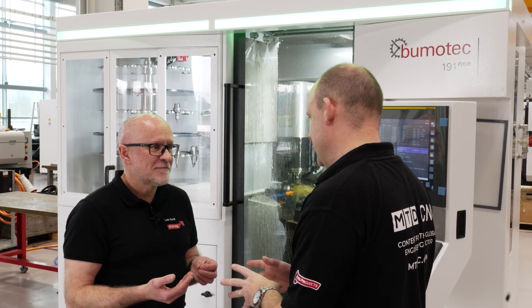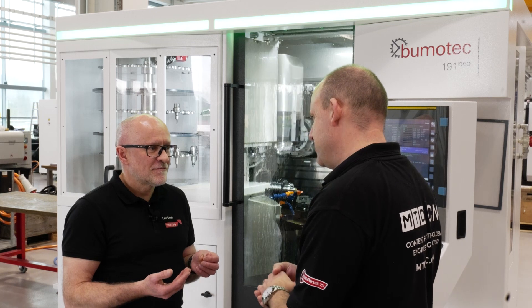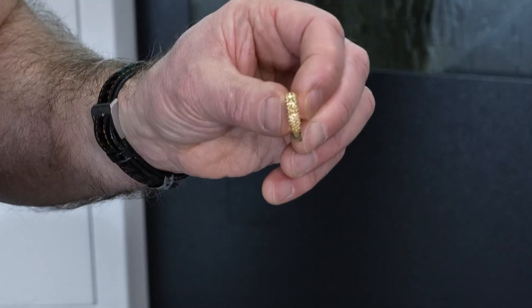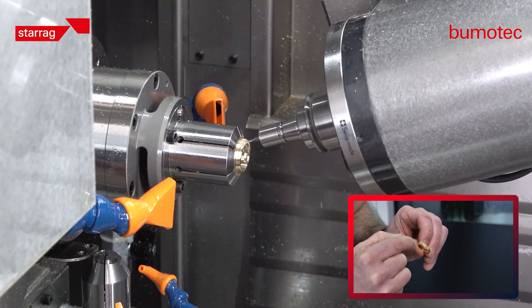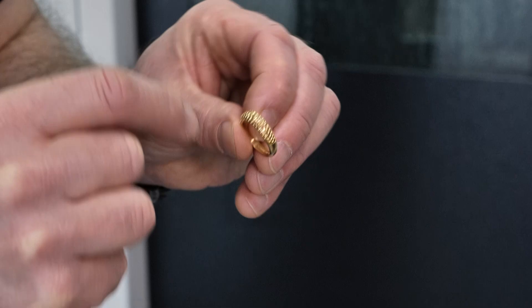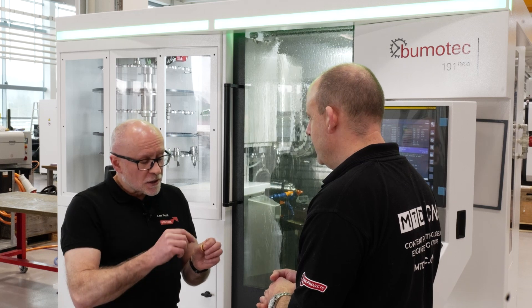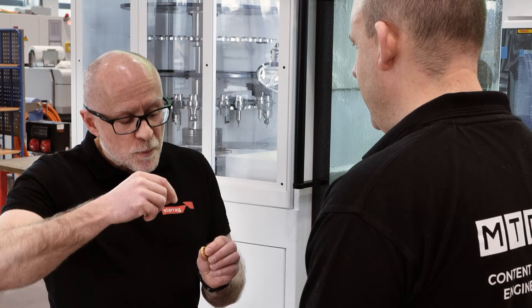Now what are the challenges other than that? Maybe you could explain how difficult it is and what you have to do to overcome some obstacles. Well, another challenge is this one here — you've got your rows of diamonds, and each one of these positions is effectively parametrically programmed, so you get the perfect size for each of the different diamond settings. Of course, then you've got the engraving on the inside as well. When these are programmed, the guys just pull out the parameters for the diamonds they're going to fit, and the machine produces the perfect setting for each stone.